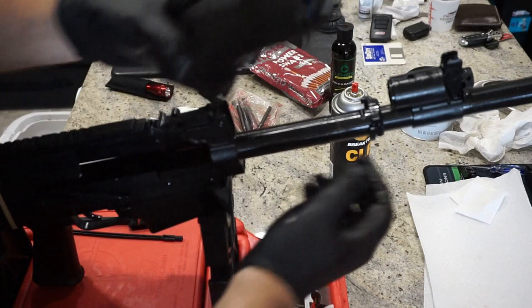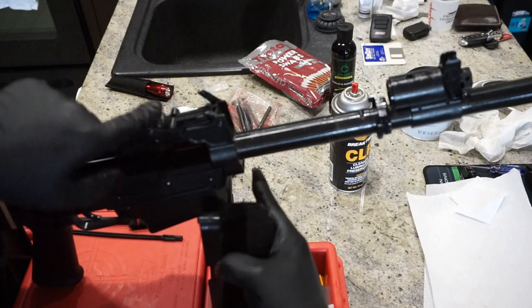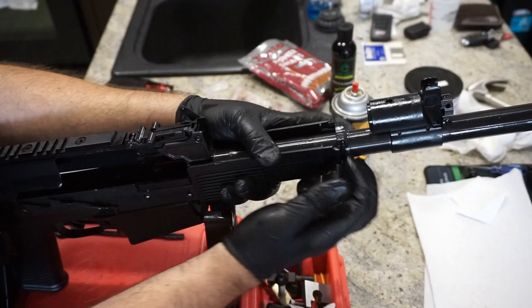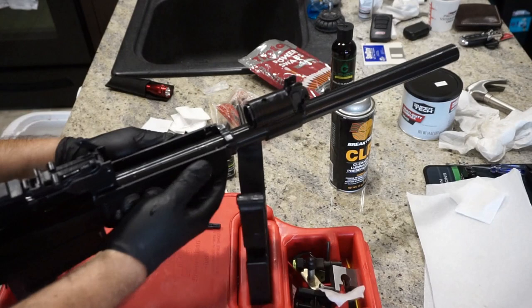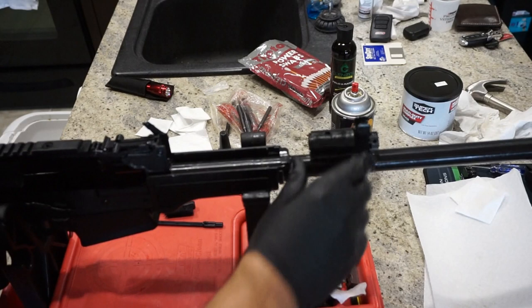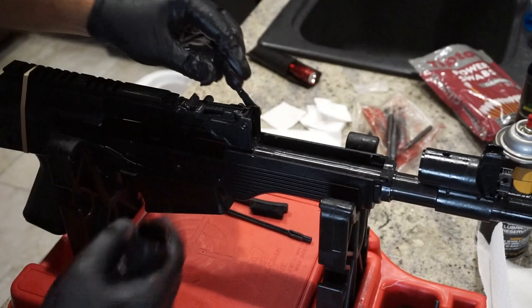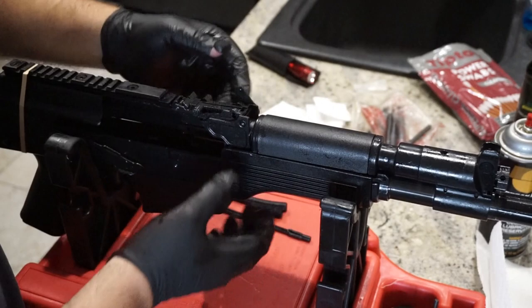There's a little notch here and your handle is going to come over and lock into place, but that won't work until you get the handguard all the way back. There's a little peg in the bottom of the handguard and some little springs that hold it in place. When you put it on, you'll have to pull back on it a little as you seat it. Pull this to the rear — it really takes a lot of force — and that little handle is going to go right back into place. Now go ahead and put the top gas tube back into position. This has to be perfectly flat in order for the gas tube to go straight down. Make sure that little lever is as flush as it can be; wiggle it a bit as you push down on the top gas tube, and it will lock into place.